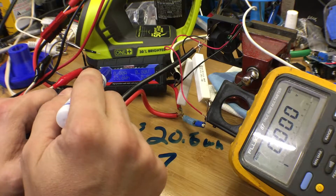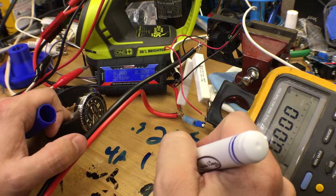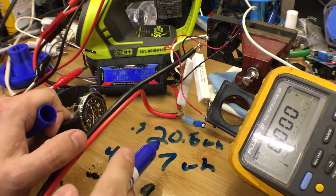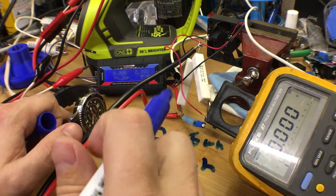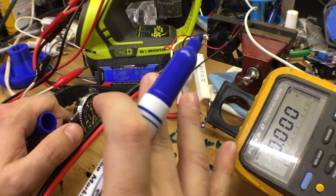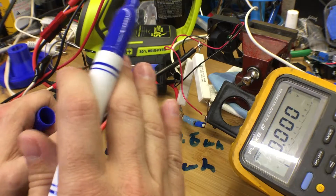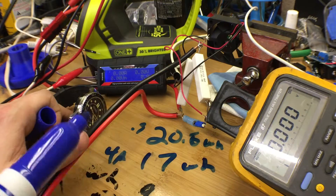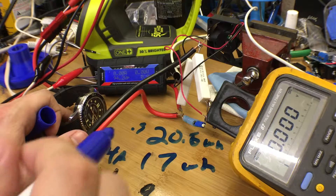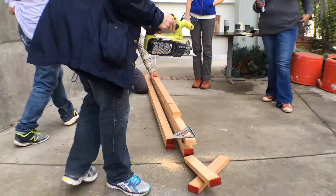On the high amperage — which was about 4 amps — we got something like 17 watt hours. We can review the time lapse tape: it was 17 and some change watt hours. So, not a huge decrease, but something — it's there. To you Johnny, if you're watching this: I understand that some papers on Peukert's Law say lithium-ion is not affected. But in a practical test here with the exact same battery pack, topped off, allowed to cool and rest, then discharged at a high amperage — indicative of a chop saw, circular saw, or reciprocating saw — we do see a reduction in watt hours.